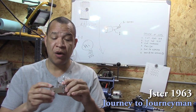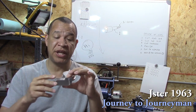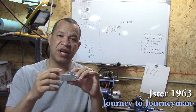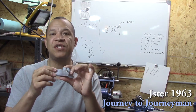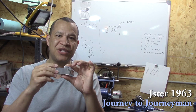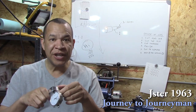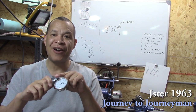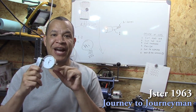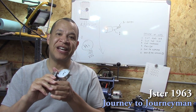Let me share a couple of lessons learned. When you have limited travel using a milling attachment on a lathe, make sure you have the full travel before you start cutting. You can chuck your piece in a little differently to give yourself that full travel — then you don't have to remove it, re-grip it, and try to get it perfectly squared up again. All in all, I really enjoyed this project. It's wonderful to take scrap pop cans and make something useful. Thanks so much for watching — I hope to see you on the next Journey to Journeyman.